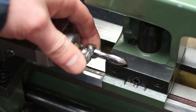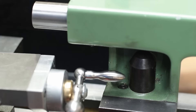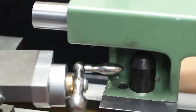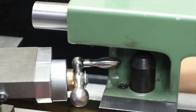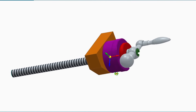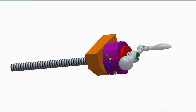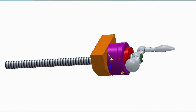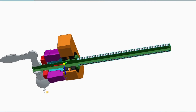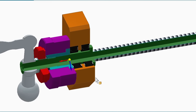I designed the whole assembly so that the hand crank can easily be detached from the spindle, as it often collides with the tailstock, especially when the compound slide is set at an angle. To see how everything works together, I designed all the parts as a 3D model first before starting to machine. As there are quite a few interesting parts to make, I decided to split the build process into two videos. This way, I could finish the first video quicker and hopefully release the second part quite soon.